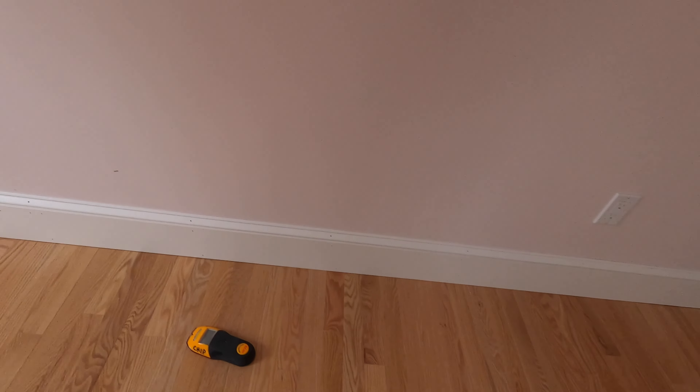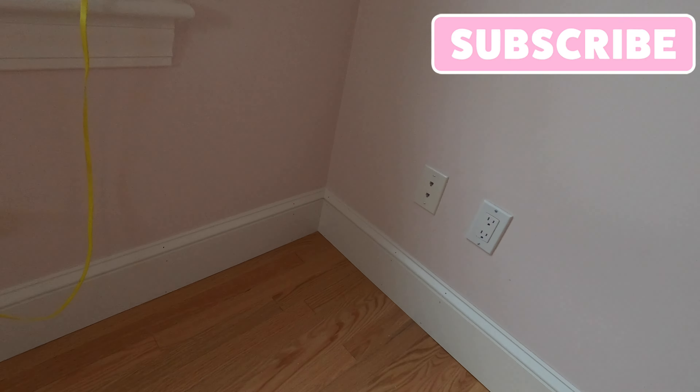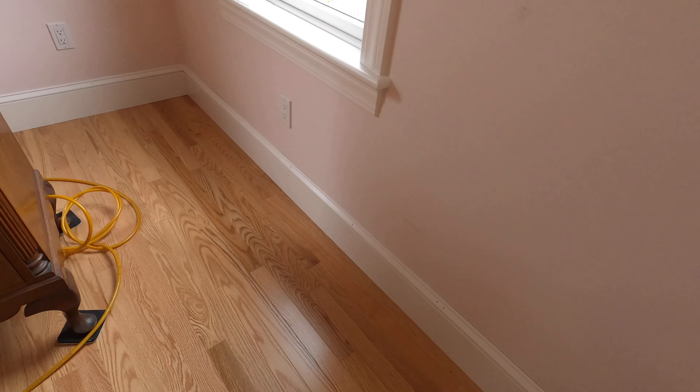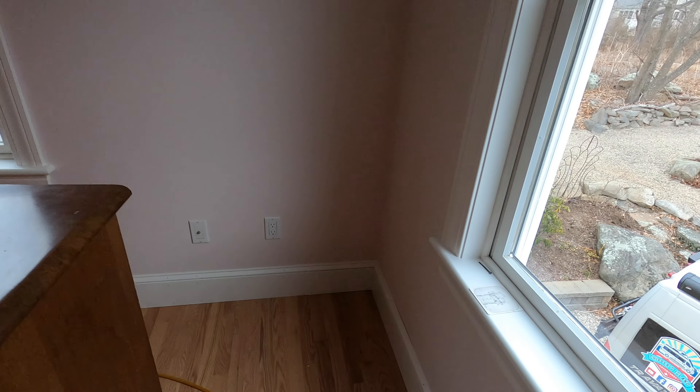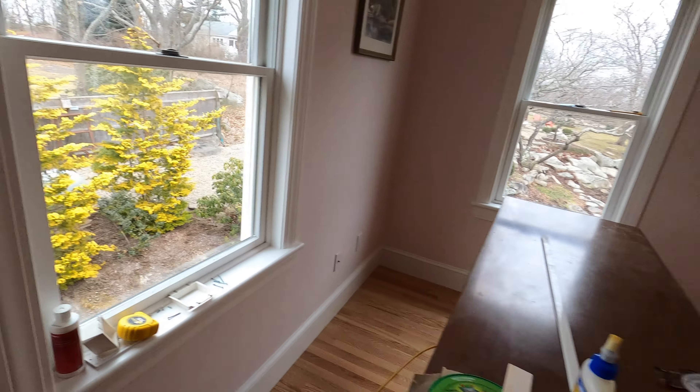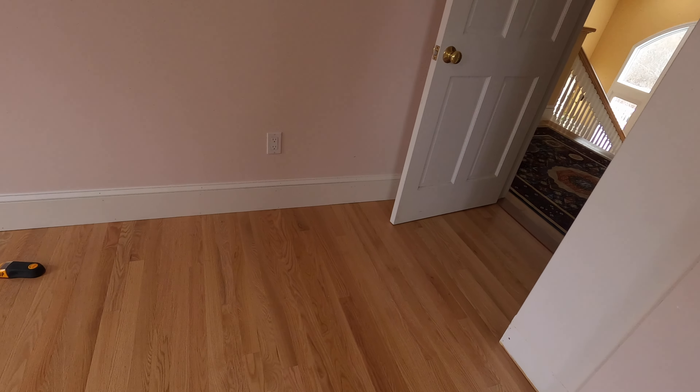We got the baseboard and cap installed on most of the walls. You can see it's looking pretty good — those are my inside corners. I haven't plugged the holes I made with the nails when I nailed it all on. I want to pay attention to how close that is to the floor. I actually did a pretty good job scribing it — there are little gaps here and there I'll take care of. This back wall was pretty straight anyway because it runs with the wood. The sidewalls were the real problem, and there was a really big gap over there initially.